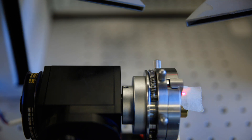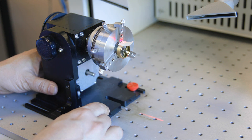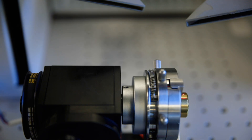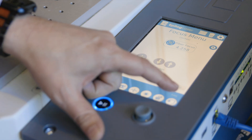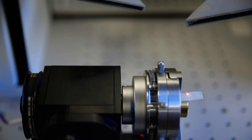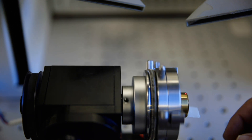We're using the f254 lens on the ring — it makes it easier to focus based on the direction the red dot pointer is coming in from. I can also reposition the unit so that the red dot is at the center point of the ring itself, so we'll know we're centered. To ensure we're going to go all the way around the ring and that my calculations are correct, I position a piece of tape on the ring right at the point where the red dot is. Then I select the trace feature and watch to make sure that it lines up with the tape on both the top and the bottom.